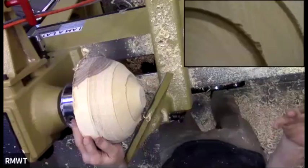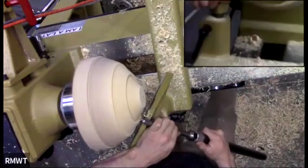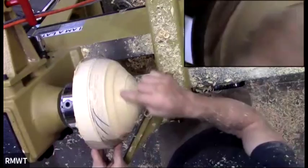Anything that can peel. If I'm doing just the peel, let me show you the peel. If I'm doing Mahoney style, Alza style, if I just do the peel, large volume, I can remove a lot of volume, but I'm still lifting the grain. Here, there it is. See, there it is. Lifted. So what do you have to do to fix that? Well, you go, oh, I can fix it. I'll just use the same gouge.